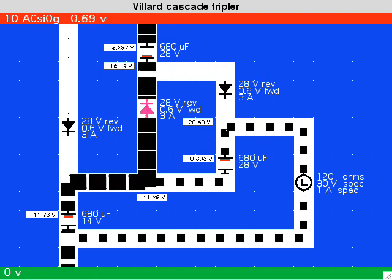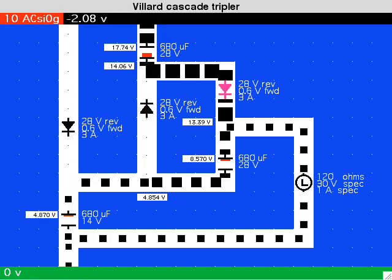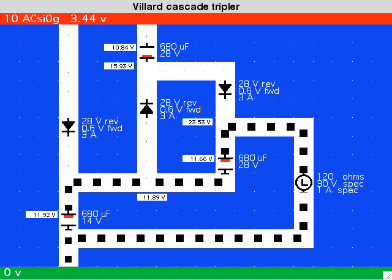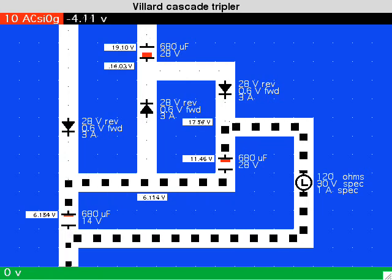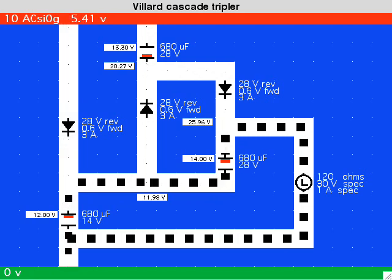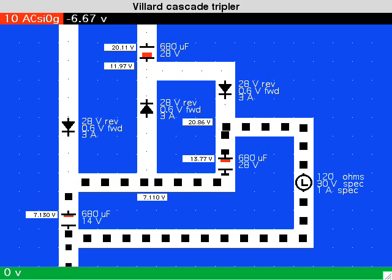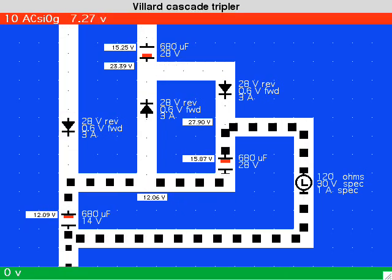We can see two charge pump capacitors operating here. This means it's charging during one half of the power cycle, then it adds its charge to current flow in the other half of the power cycle. This effect can then be used to apply twice the voltage to another capacitor down the line. In this manner, each successive stage cascades the voltage upward.